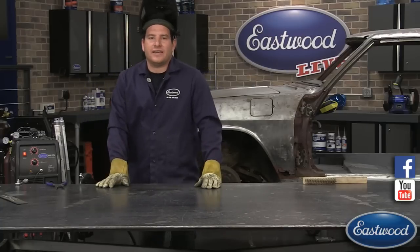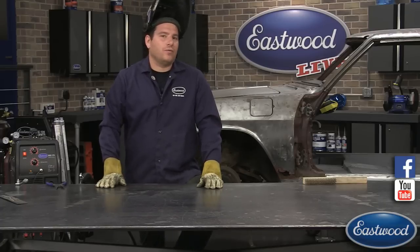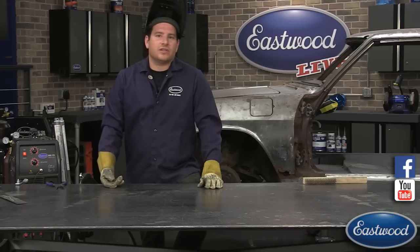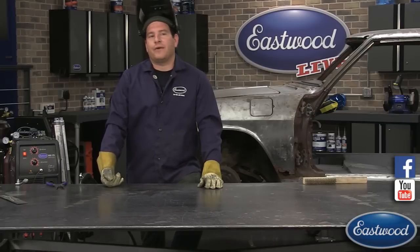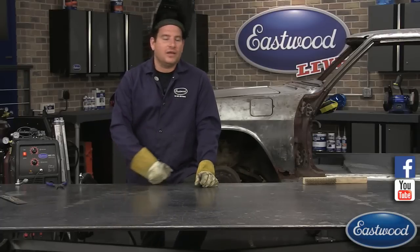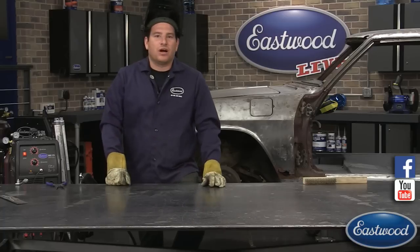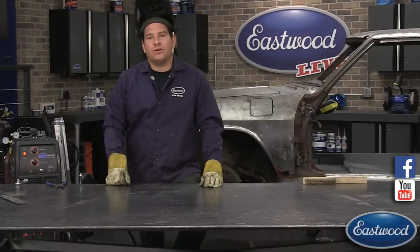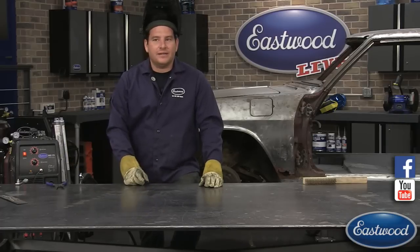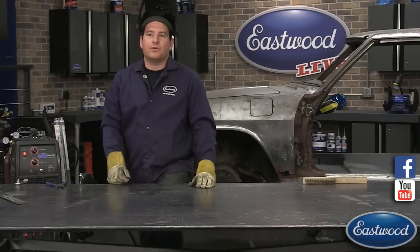Another thing that can cause that is improper preparation of the weld joint. So MIG welding versus, say, TIG welding, it's a lot more flexible, you can get away with welding something that might have a tiny bit of surface rust, or I know I've done it with welding floors in a car, maybe there's a little bit of seam sealer left next to where you're welding, and you just brush it away and plug along because you don't feel like cleaning to perfect bare metal, or a little bit of paint. You can get by with it, but if you start seeing pitting like that, from stuff around it that you didn't clean properly, that might be one of the reasons.